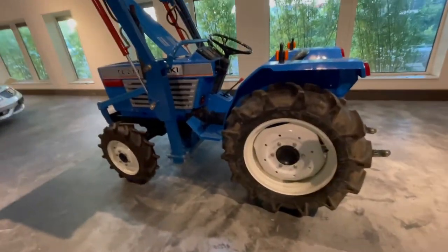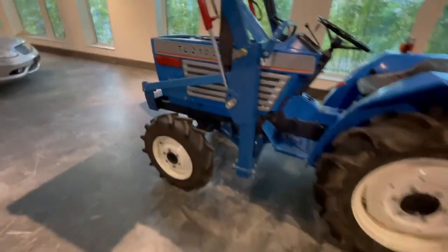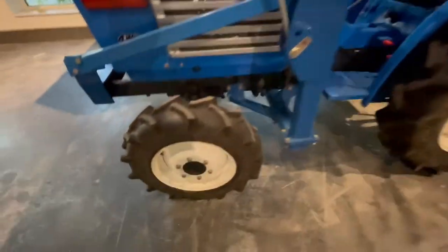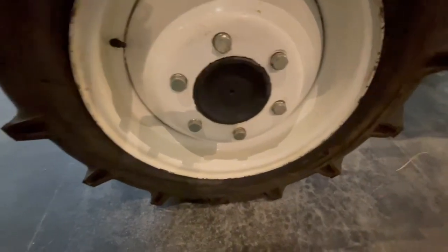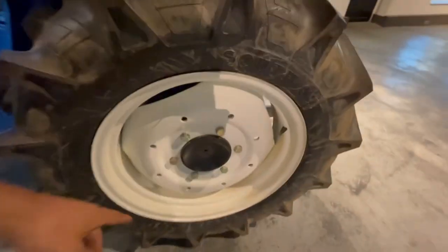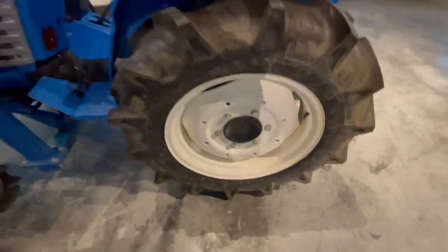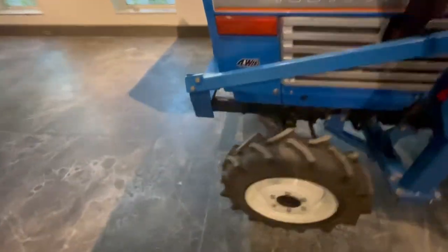This problem is really common and I've had it before. These rebuild tractors are done really fast. What happens is most people forget to take care about the bolts, and these are all worn out. Also from the front wheel, you can see it's a little bit black and oval — that's not good. They've redone all the bolts and I think it's okay now, but some bolts are still missing. Please always check this. If you buy a tractor with a front loader, you will go forward and backward many times, so it's really important to check these bolts. If they are loose, it will become a real problem. As another example — this bolt is missing, this one is missing. Many of these bolts are missing.